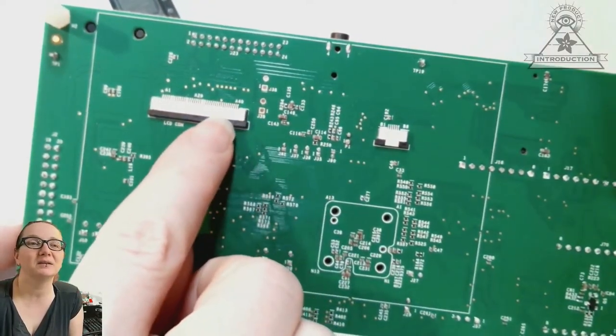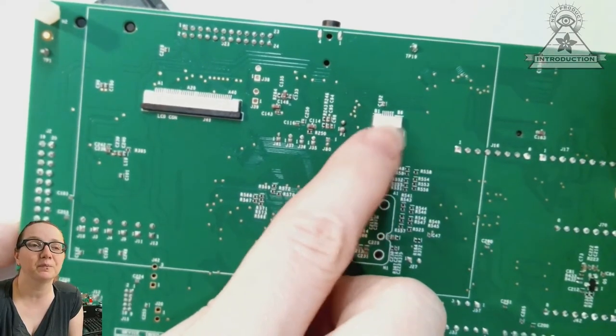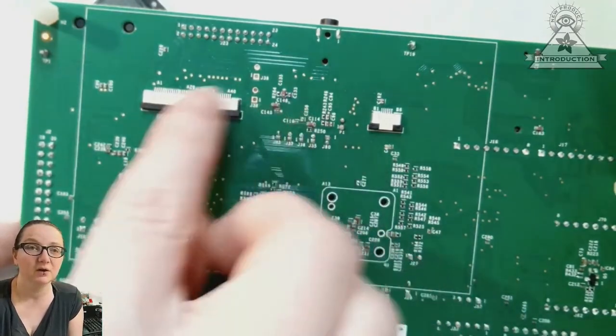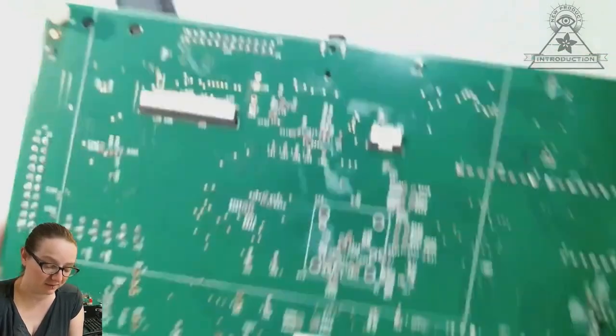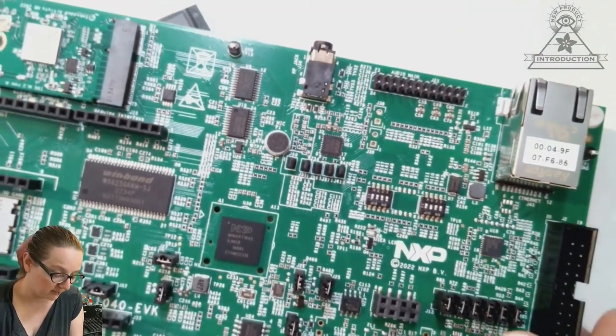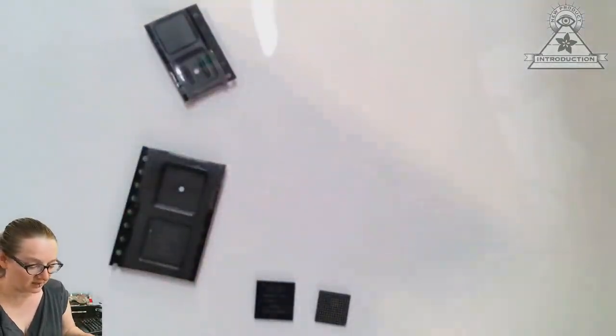On the bottom, you can see the parallel TFT 40-pin connector and a 6-pin connector which has a pinout for capacitive touch — almost certainly they go together, giving you a capacitive touch interface over I2C and the parallel TFT. And for that display you'll need to buffer it, so you'll have to pop on some extra RAM, which is probably what that nearby chip is.